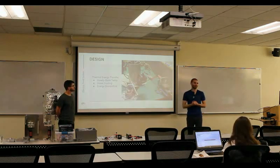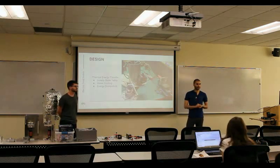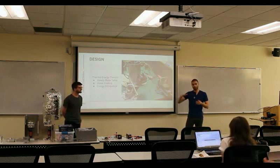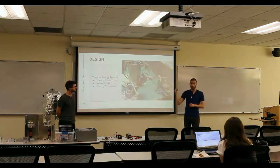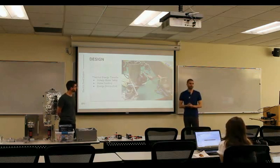We got to play with a FLIR camera, which was pretty cool. Someone asked if we dynamometer the motors — we don't have access to a dynamometer, but it would have been really useful to hook it up to see what power output we actually get. A dynamometer — or dyno — measures the actual power output after all losses. You know power from voltage and amps, but a dynamometer tells you exactly what the motor is actually putting out in real life, accounting for losses. I don't know if Portland State has one for RC-scale motors, but someone could likely make one.